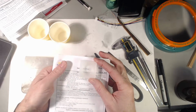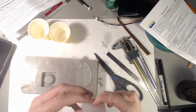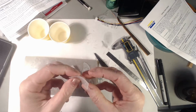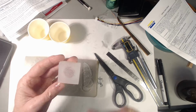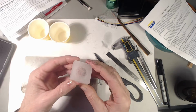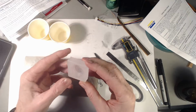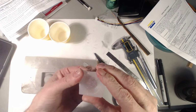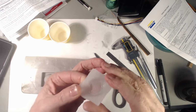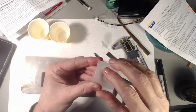Although, as you can see, this Sorta-Clear is quite clear, since we can read text through it. And this top section feels like it's about the same thickness. So to make this transparently clear, we just need to suck the bubbles out before pouring the silicone in. But that's very cool. Let's see whether I can invert that. Probably can't, it's too thick. But you can see the stair steps in there, which I can eliminate by tweaking the Fusion 360 CAM operation.